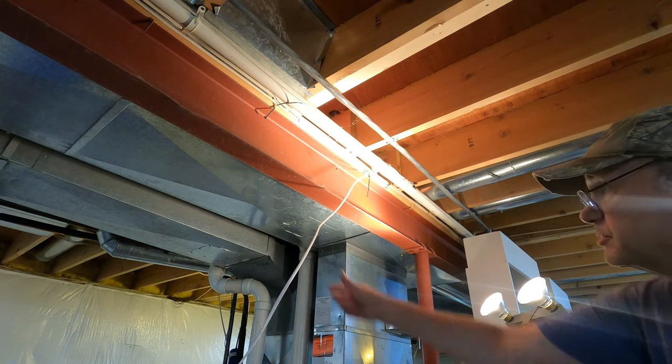So here's the relay schematic I copied from the manufacturer's product cut sheet for this relay. Let's review what the hazards would be in miswiring this relay. On the left, we can see the coil and its wiring taps. On the right are the two poles of this relay. Here's pole 1 and pole 2. We can see that each pole has a normally open and normally closed contact, and there are three wires coming out of the relay for each of the poles. Blue, yellow, orange, gray, purple, brown.